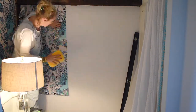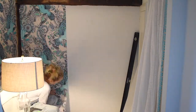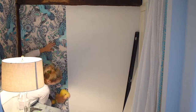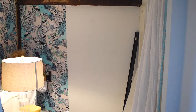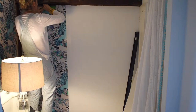Then I bring it into this space and I line it up with that vertical line, and I use a sponge to smooth it out on the wall. One thing I love about traditional wallpaper is that you have a little bit more forgiveness so that you can shift it around to make sure it's vertical. I smooth it out with that plastic scraper, making sure that all air bubbles are pulled out towards the edges of the paper.